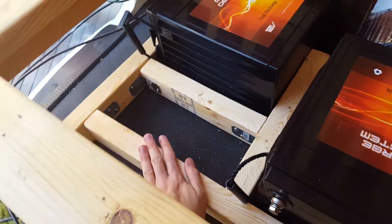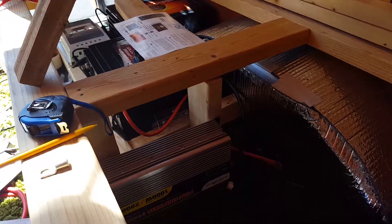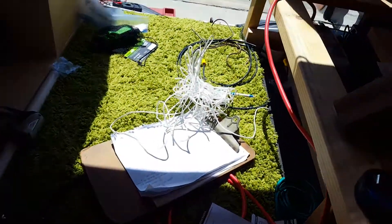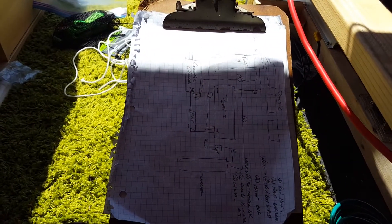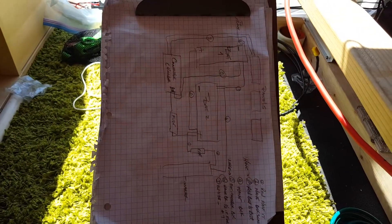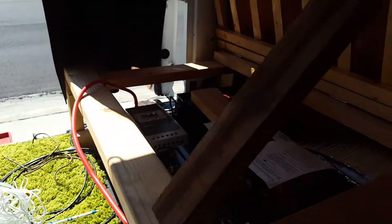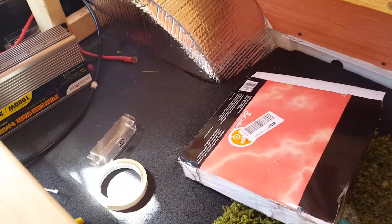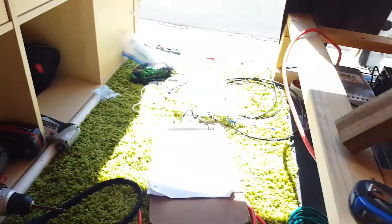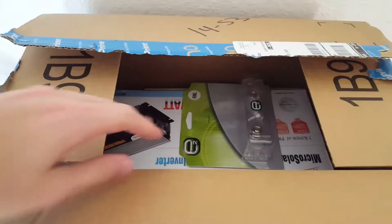You can see I built a wood frame around most of the solar components. System voltage is determined by your batteries: one 12-volt deep cycle battery is a 12-volt system. Two batteries in parallel is still 12 volts but doubles the amps. Two in series gives a 24-volt system. I recommend the parallel 12-volt system since most of my appliances are also 12 volts.